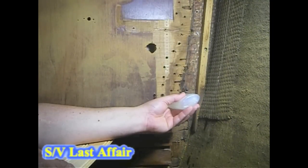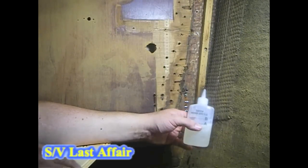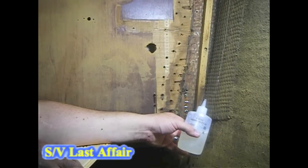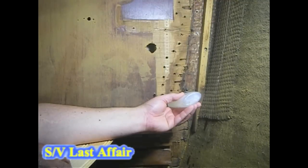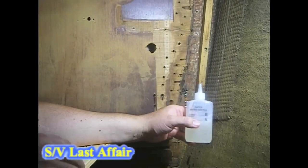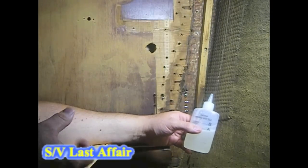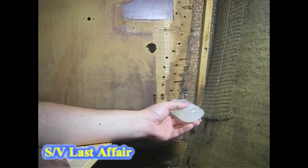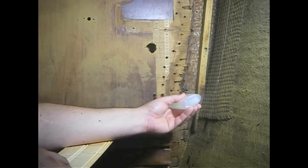It is important to note that all the instructions say there's not a product out there that actually displaces moisture. So this repair will only work if the cause of the water intrusion or the leak has been resolved and the wood is thoroughly dried out. Normally what people would do is drill holes like this and put a fan on it for days or weeks at a time, whatever it takes to really eliminate that moisture in the wood. If there was still moisture in the wood, we would essentially be packing that moisture around the epoxy resin. It's just best to ensure it's dried out before trying to penetrate it.